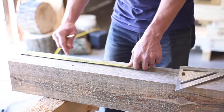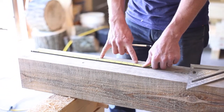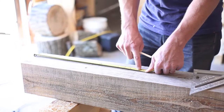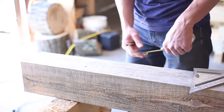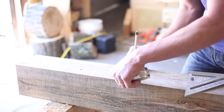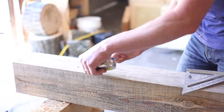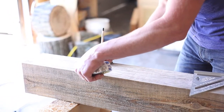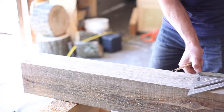The posts are set in a foot from the end, and it's a six-inch tenon, so we're coming from 12 inches out to 18 inches. We're going to use this side as our reference face, so we're going to come in two and a quarter and three and three quarters. Two and a quarter, three and three quarters — and we'll carry these lines across.